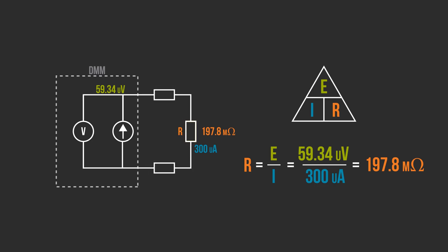This means the meter includes the resistance of the leads in its measurement. Remember that Kirchhoff says that current through individual components in a series circuit is the same, while their voltage drops add up. With the two-wire measurement, our meter provides a constant current through all three resistances, but it has no idea about the voltage drop across just the resistor under test.